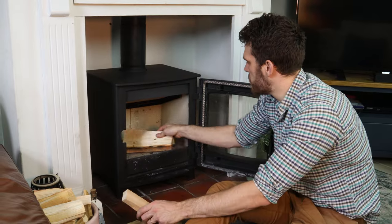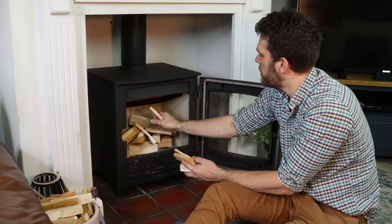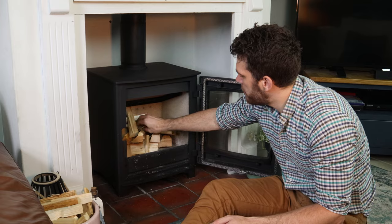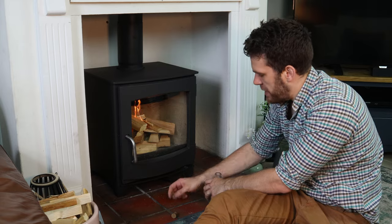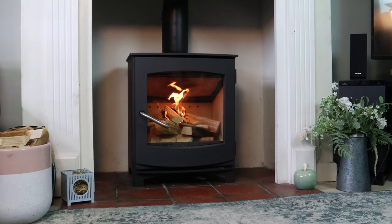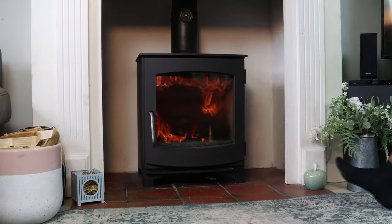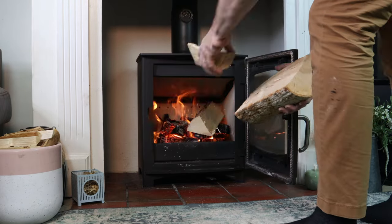Small logs on the base as always. The important thing is just getting airflow between each piece. It's not that you have to set it up in a particular way — you just need gaps. Then a firelighter. Leave the door just ajar, the vent fully open. Getting it up to temperature in a quarter of an hour is no problem at all. Just look at that control. It can flame out a little when you first open the door, but that is part of having a really efficient stove.